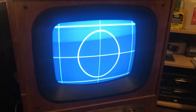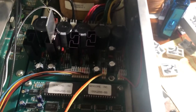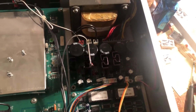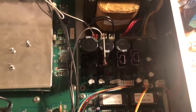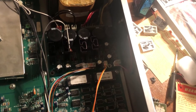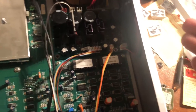Alright, well that was the weirdest thing ever. Let me explain what I did. I replaced all of the smaller caps — that one, that one, that one, that one, and that one on the board — and the fuse kept popping. It's nighttime now and I've been going crazy. The fuse kept popping. Then I noticed a diode — see where it says CR13 right there? There was a diode across there, a 1N4004. I replaced it and it kept smoking and the fuse kept popping. So I said alright, let's just take out the diode, hook it back up, put a new fuse in, and see what happens — see if another diode smokes so I can at least trace it back.